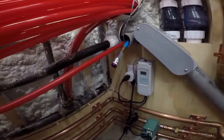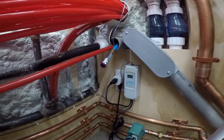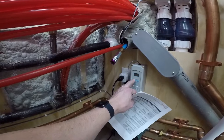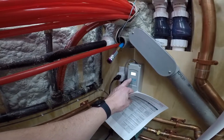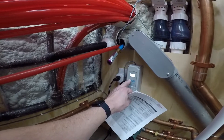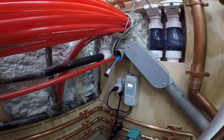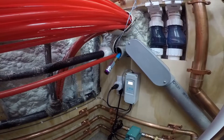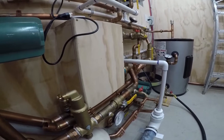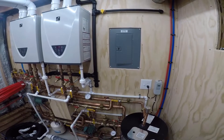Let's turn this back on and see if we can figure this out. If we're set at 110 with a 3-degree differential, it shouldn't come on until it drops to 107. So maybe that was it — I think I had it at 113 with a 3-degree, so anytime it dropped below 110. And that's hovering right around 111, because that must be what I had the 3-way mixing valve set at. It's close to 111 — I had it at 120 but we were getting those temperature swings, and actually I still experienced that this morning in the shower, so I still have to dial that in a little bit more.